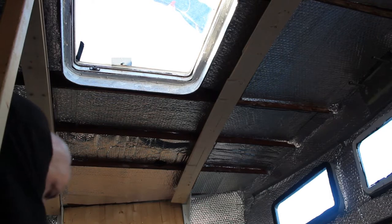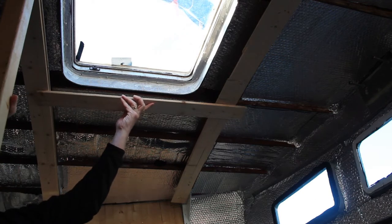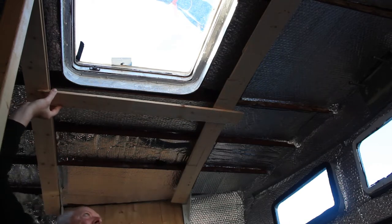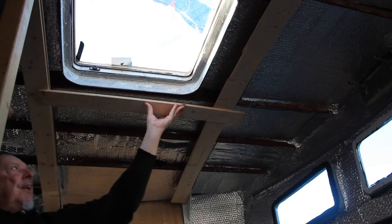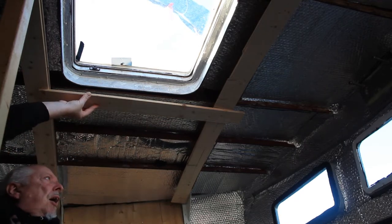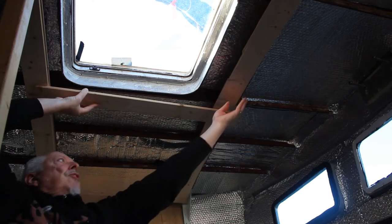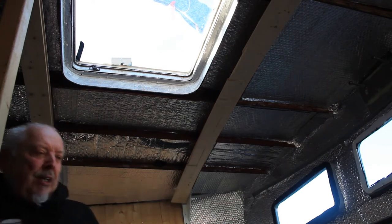So that's the two main bits fitted in and the idea is that the cladding will just go across from sort of here. I was going to say halfway across that, but I'm thinking in terms of not cutting them — just having that bit going over, fixed in like that all the way across, and then I'll have another piece of this wood across here. And then the join will be there. It'll save cutting a lot of wood unnecessarily.